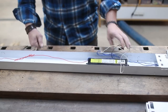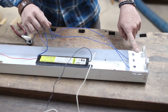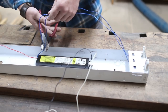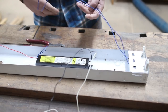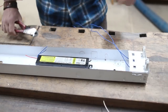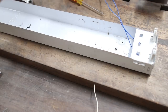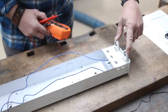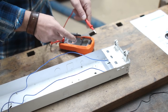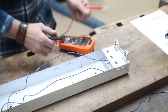But let's say you want to do a single-ended connection on an old fixture that's double-ended — too easy. Pick one side of the fixture to be your connection side. I'm going to be using the blue side, the side with the blue wires, and cut them off on that side long enough so you can work with them. The rest of the wires from the ballast can be eliminated — we're not going to use them at all. Then you can either leave the ballast inside the fixture or unscrew it and remove it and dispose of it properly. Back on the power side, we got to make sure that the tombstones that were originally in the light fixture are not shunted, and the best way to do that is with a voltmeter.